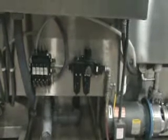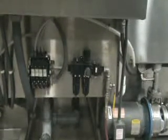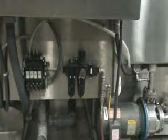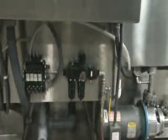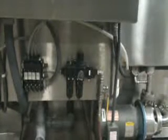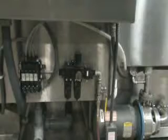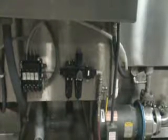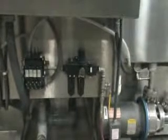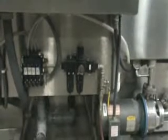With a regulator and an air filter, you will be required to provide 80 PSI dry air. Oil-free is definitely what you want to go with. It's nice if you're in a humid environment. Also, if you have a dryer system — a refrigerated dryer — to remove moisture from your compressed air lines, because the solenoid valves and the pneumatic cylinders on the machine don't like water in them.